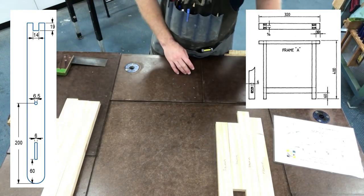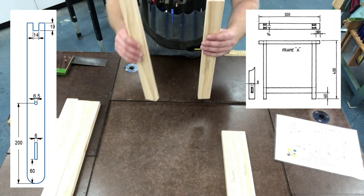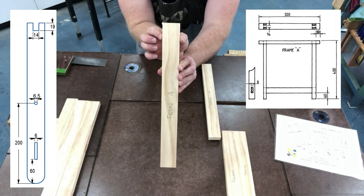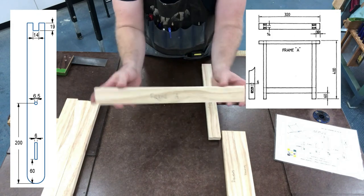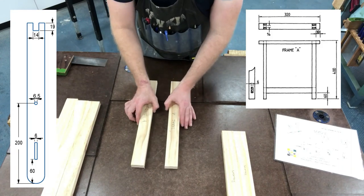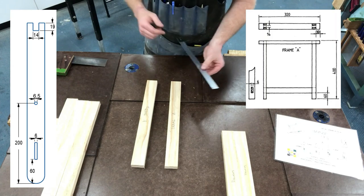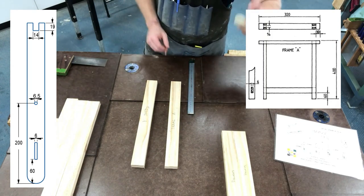These are my legs. The width of our timber is 42mm, the thickness is 19mm — that's the stock size. These have been docked down to a length of 400mm. We're going to start by marking out our legs. Grab your steel rule, and as I said before, make sure you have a sharp pencil and an eraser in case you make a mistake.